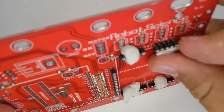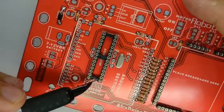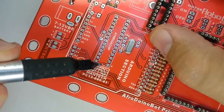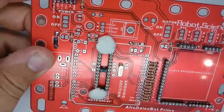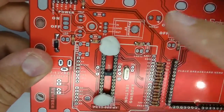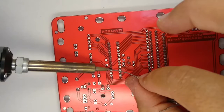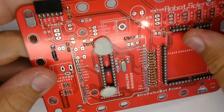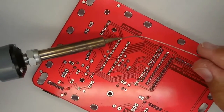Next, place the microcontroller socket on the printed circuit board, making sure the little half-round notch on one end matches the silk screen drawing, oriented towards the bottom of the board. Follow the same procedure used with the socket strips — use press stick to secure the part in place while you solder. Solder only the four corner pins of the integrated circuit socket first, then check for alignment, and then complete the soldering of all the pins.